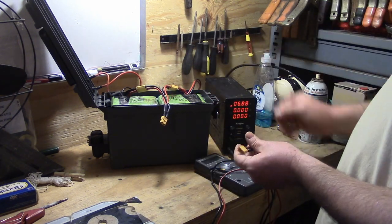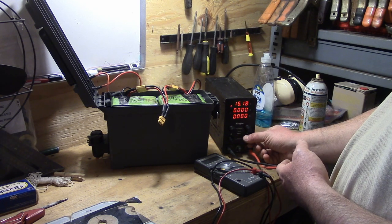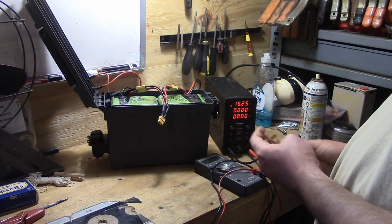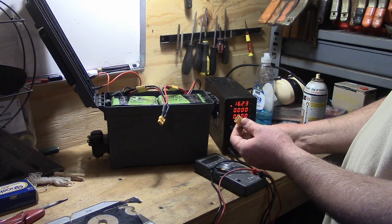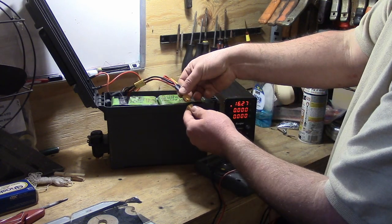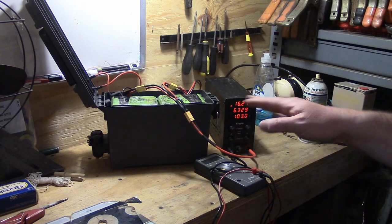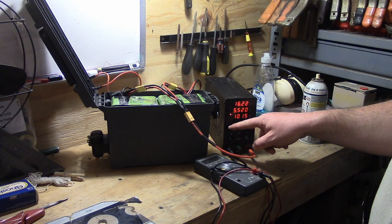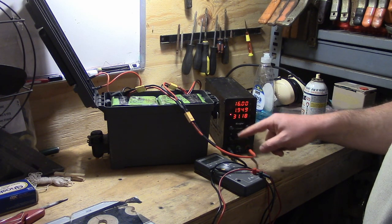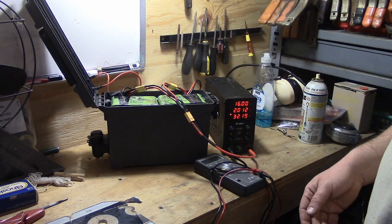So first I'm just gonna set my voltage. I'm just gonna noodle that down to 16.25. How about that? We'll bump it up a bit since last charge maybe. Whoop. It totally doesn't matter at that tiny bit of difference. And then we'll plug it in. It's putting in 6 amps, which it can totally take, but just to keep the batteries cool, since I'm not in a hurry, I'll just do a couple amps or so.